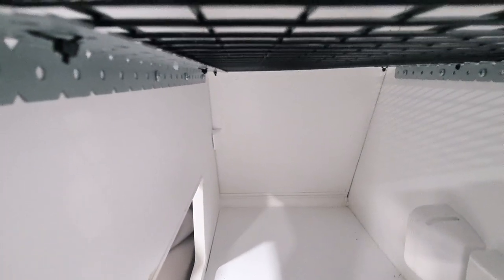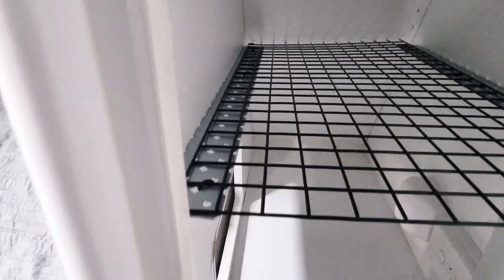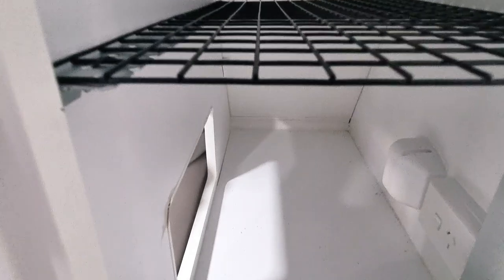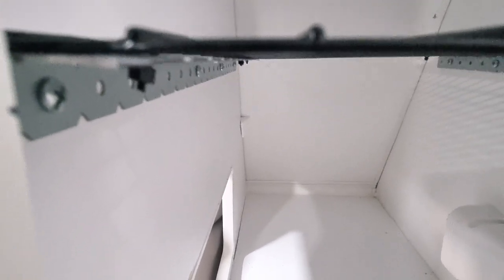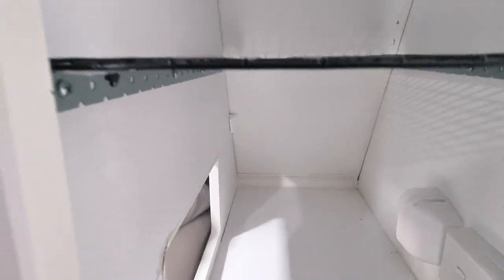As you can see, there are two brackets — there's one that's a double and then a single underneath. The double on top gives you more strength to hold the frame. What I've done is just put little screws in — the screws are 16mm. They're a decent size and thick but only short. You don't want tiny little screws but you also don't want them too long, because of the cupboard on the other side — you don't want them coming through.